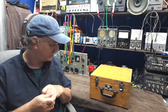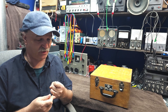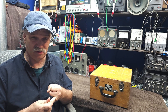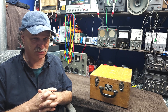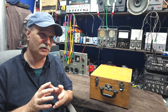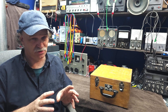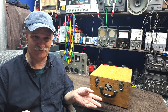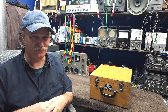This is one of the more interesting ones, and there are others coming. From dealing with these models in the past, I know there's one wax paper capacitor inside, so I want to see if that's been changed — if not, we'll change it. I want to put a new line cord on it, and of course clean up all the dials, sliders, and switches. There are about 10 resistors inside relevant to tube testing that we should check, and if they're out of range we'll replace them.